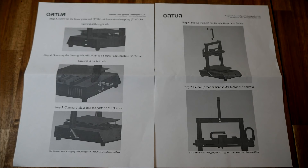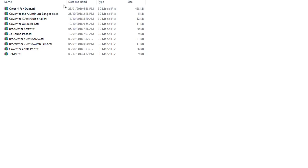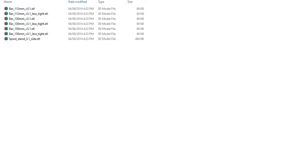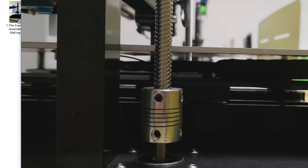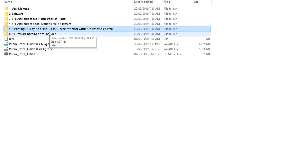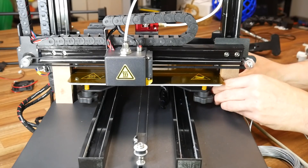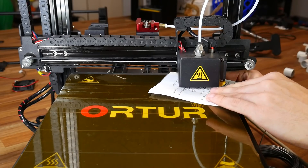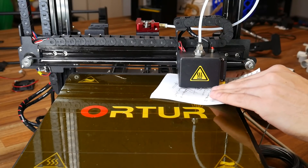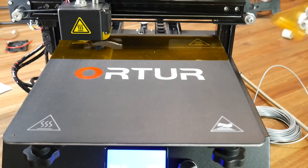The printed instructions were pretty ordinary, but it's worth mentioning what was on the SD card: more detailed manuals in PDF format, a copy of Cura, a USB driver, STLs for all of the printed parts on the machine, and most significantly a set of pictures and videos to help with troubleshooting initial prints, plus a hex file of compiled firmware. As this printer has dual Z lead screws I used the supplied wooden blocks to get everything level before using a piece of paper to level each corner of the bed. The gold tape on the bed is Kapton tape — quite an outdated surface for 3D printing — so I peeled it off as the instructions said nothing about keeping it.